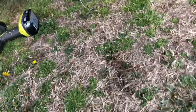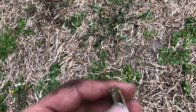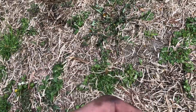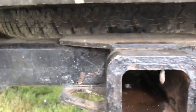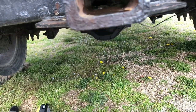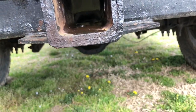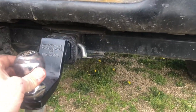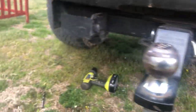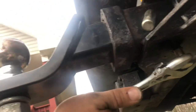All right, let's have a look at what I've done. I went and drilled out a hole and used a tap — if you've never used one, you drill a hole slightly smaller than the tap and bolt you want to use, and it cuts threads so you can screw your bolt right into it. There's a good amount of meat in these things which gives you thickness to hold the threads. So I've stuck my receiver in — I haven't tightened the bolt yet — and you can see it's still all over the place. Let me give it a good crank and see how effective this is going to be.